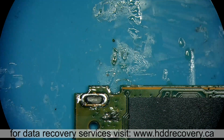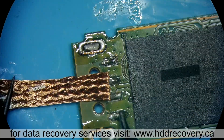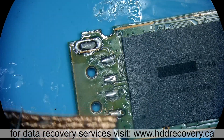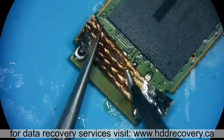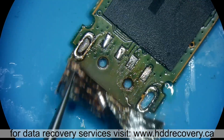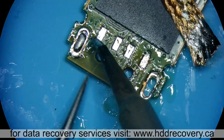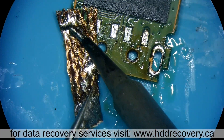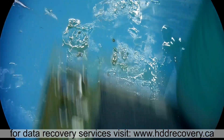The connector was basically liquefied to the point where the anchors just slid right off. All of the pads seem to be intact — no breaks on them. I'm removing the remaining header parts from the connector and preparing the area for the new one. The reason I removed it is that whoever worked on this device last time overheated the connector, and something inside may not have been aligned properly — that would be a really rookie mistake. I have literally hundreds of brand-new connectors in stock, so using another one isn't a big deal.